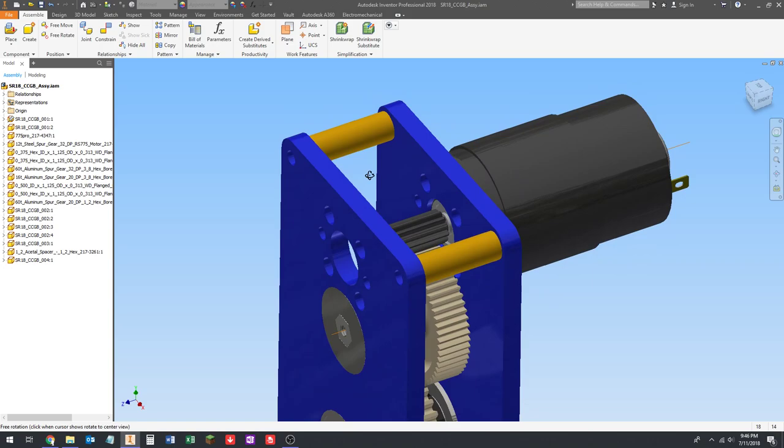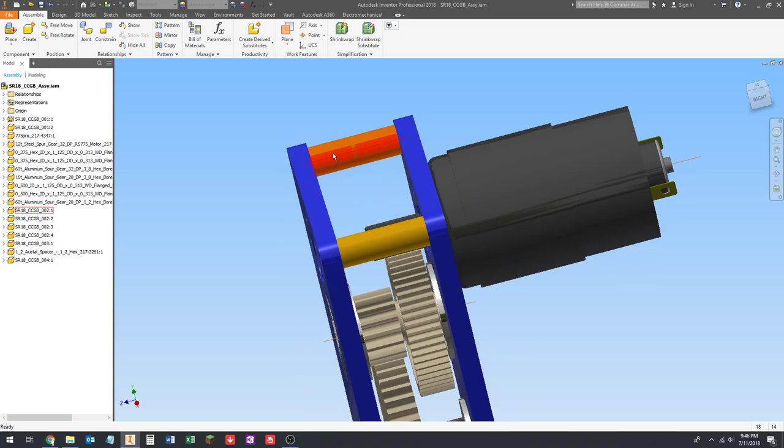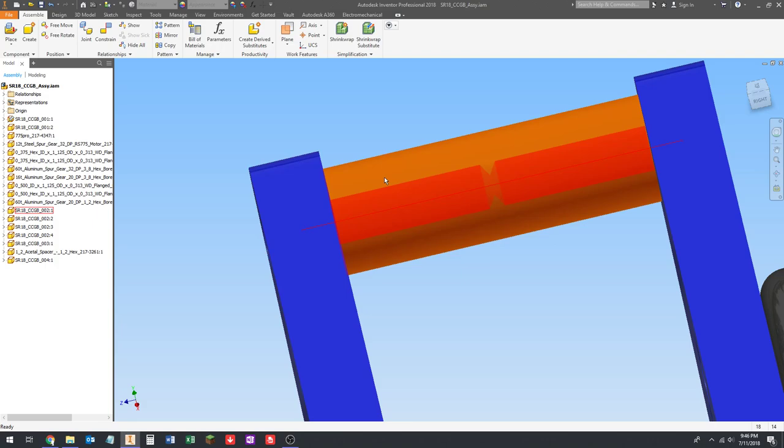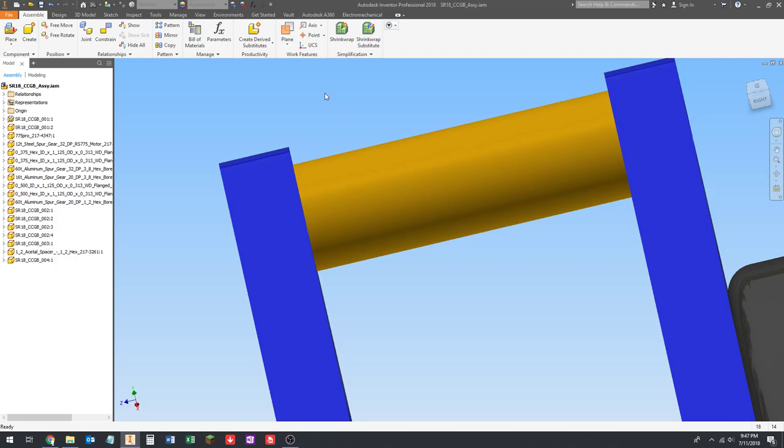For 1032, I want roughly a quarter inch of engagement. So I need a quarter inch of length here, and a quarter inch of length in the standoff. The end of the screw is tapered a little bit, so you don't have full threads at the end of the screw. You also aren't going to have full threads right at the beginning of the standoff, because the beginning of that hole is going to be chamfered when we deburr it.